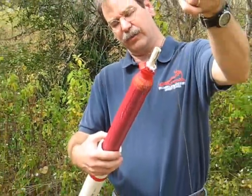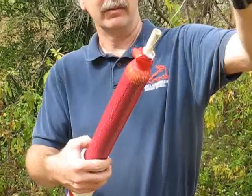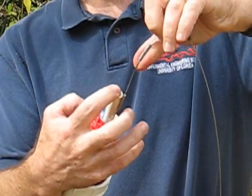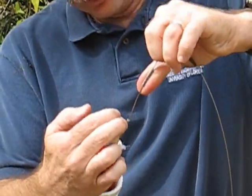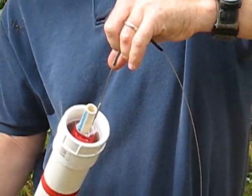The flux meter itself basically has a red mesh protective material on the outside. It's two inch diameter, and when we push it into the well, we'll be pushing on this center PVC tube connected down to the bottom. When we push it in, it's really pulling from the bottom of the flux meter and sliding it into the well.